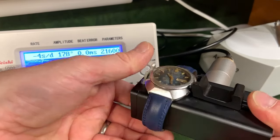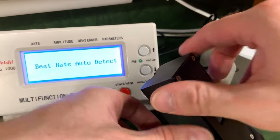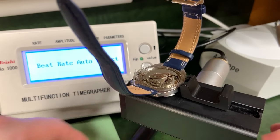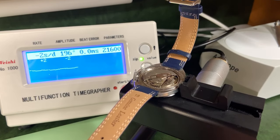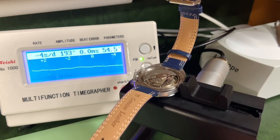And the last position — I'll often turn it the other way around for this. So we'll just put it in like that. I always think the dial down is the easiest position. You'd usually get the best reading from that because the balance has a natural reaction to gravity and it pulls it down into the jewel setting better and runs more efficiently. And as you can see straight away, I don't think we can get much better than that currently. We're at a perfect rate, perfect beat error, and the amplitude is pretty close to 200, which is always my target. So that is very impressive — very impressive indeed for a watch that is in such a rough, rough condition.